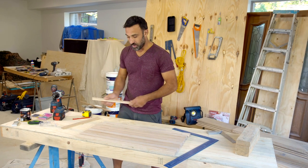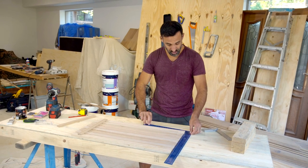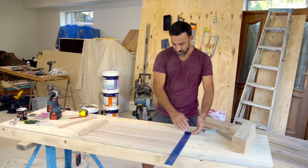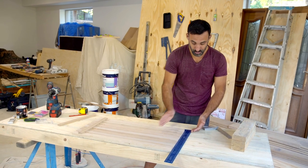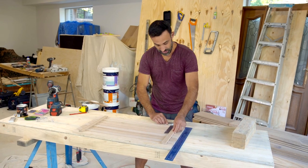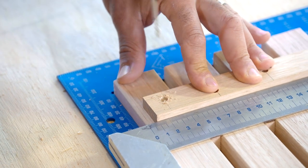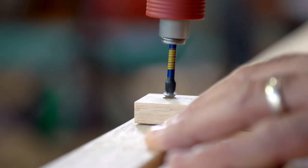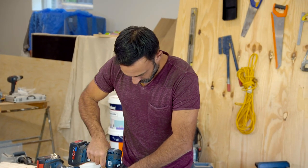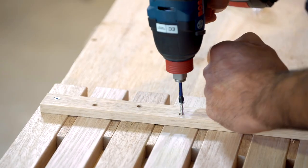With our battens pre-drilled and countersunk, we can now sit them back on our mat. I've got a roofing square here which I'm going to use to square up the mat first, making sure it's touching along this face and then along this face with all our pieces. Then I'll get my set square and the other batten and use that to square up our batten, then just pre-drill into our slats and fix them off with some stainless steel screws. A good tip is to make sure that you pre-drill and screw off all the corners first — that way it's holding your frame nice and square, and then you can pre-drill the rest of the holes and screw it off at the same time.